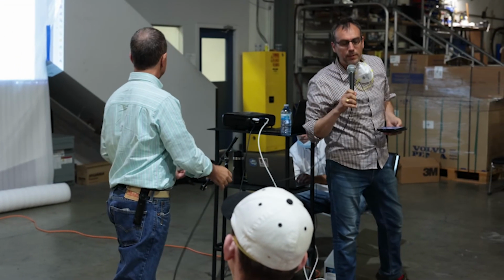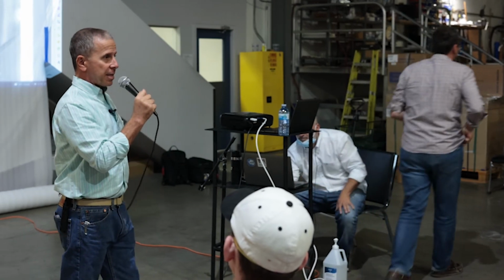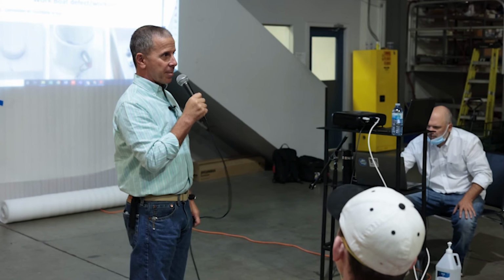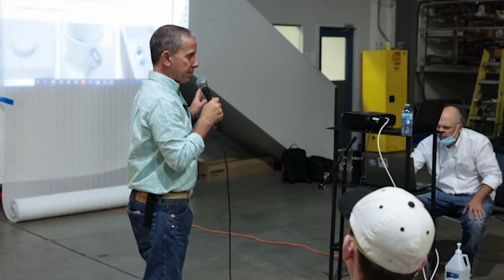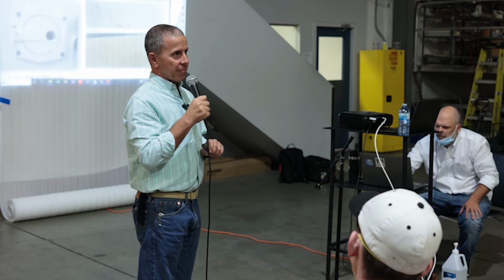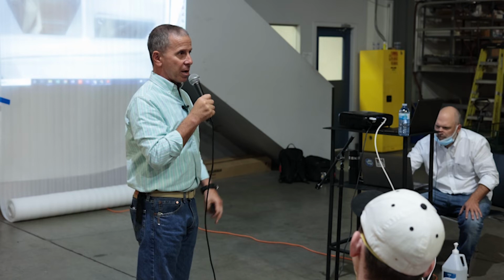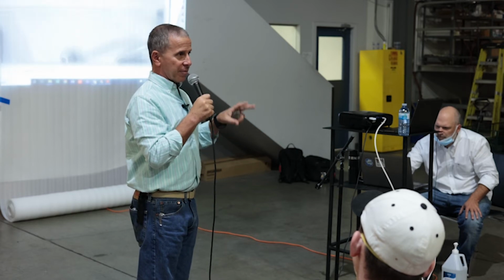Your view on aluminum and teak. Yeah. Okay, so teak is a hygroscopic material. It holds water like any timber does. I can't begin to tell you how many very expensive aluminum failures I have seen and been involved with repairing for aluminum vessels that have teak decks.